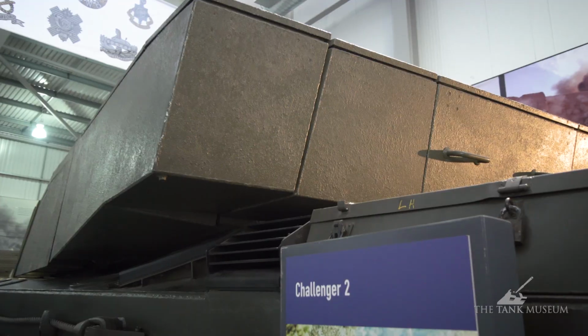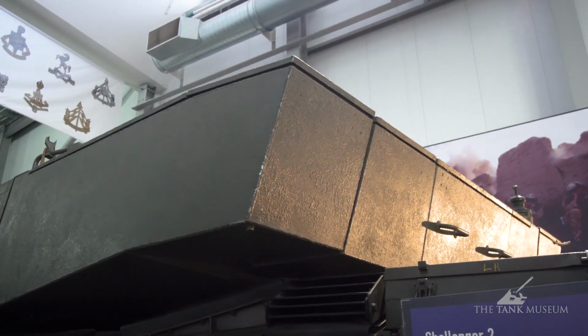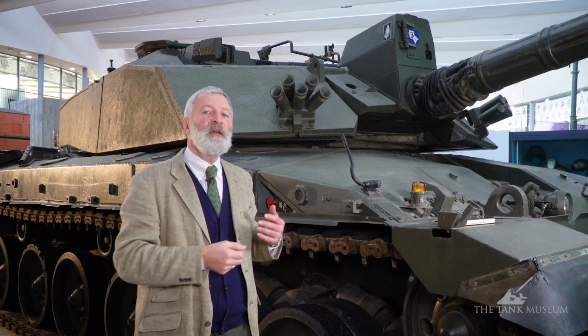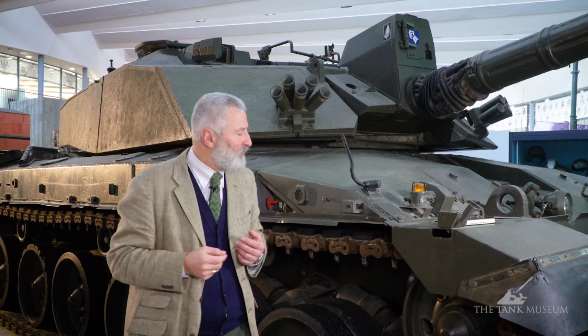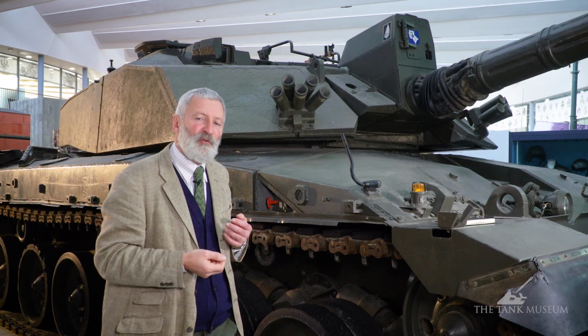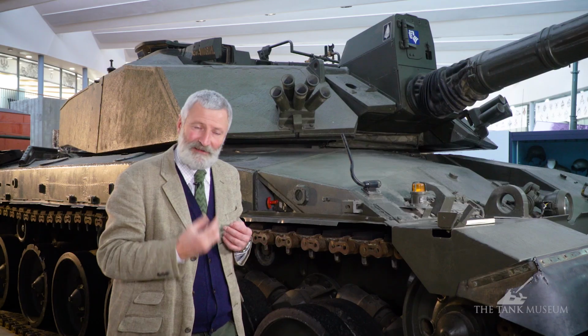And when you're looking at the outside of a Challenger 2 tank, you're really looking at a skin. The key armour protection is underneath. So, for example, with the turret, it's got a cast front, welded back to it, but then the Chobham armour packs are put on there, and this thin metal skin is welded over the top. So underneath is a key element of Challenger tanks, that very interesting matrix that makes up Chobham armour, which has tremendously good defensive capabilities, not just against kinetic energy rounds, but chemical rounds as well. So really important feature there. And as I mentioned earlier, or will mention, a very important thing that gives confidence to the crews, because the survivability of a Challenger is outstanding.